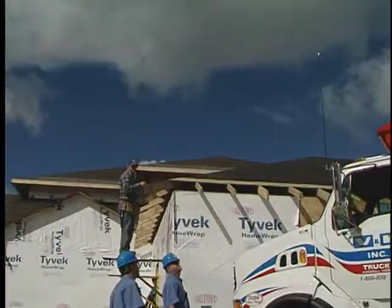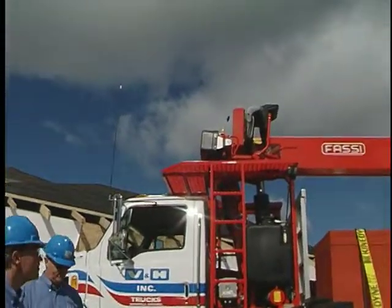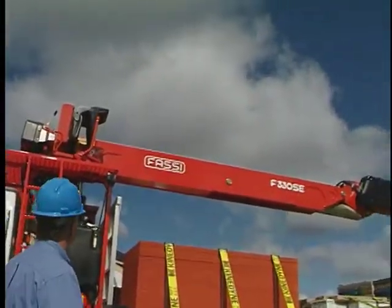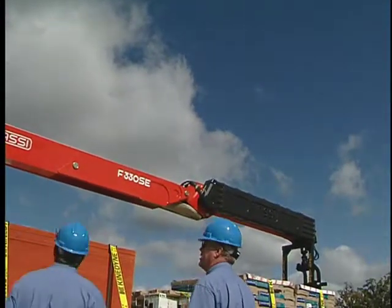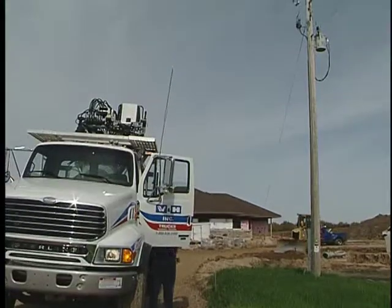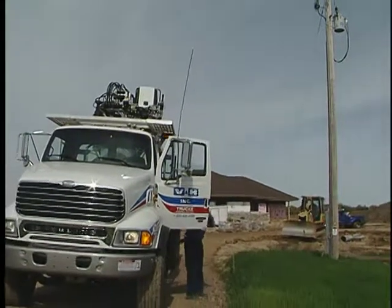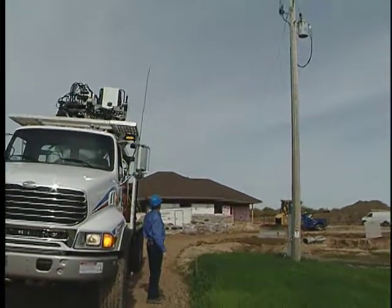Look above you in the area where you intend to park and see if any power lines, permanent or temporary to the work site, present a hazard. Occupational Safety and Health Administration, OSHA, policy requires 10 or more feet between any part of the crane, load line, or load. This distance will vary depending upon voltage.